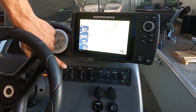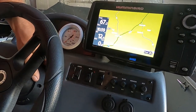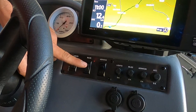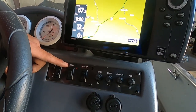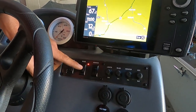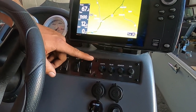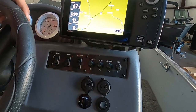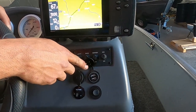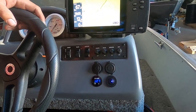Going through the switches on the dash: far left is your navigation light — press forward and the green and red lights light up; press further and the anchor light and transom light up as well; down is just the anchor light in the rear. Next switch over is your bilge pump — it's on an auto float, so if you ever notice a red light come on without flipping the switch, it's automatically pumping out water from bad weather or splashing. Flip the switch up to manually turn it on. The next switch is for your aerator — that's for the live well, so you flip that switch to flood the live well with water. The customer also added a 12-volt plug, USB ports to charge your phone, and a voltage gauge that reads 12.7 volts — a quick and easy way to tell you've got battery power.